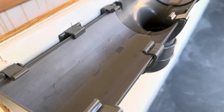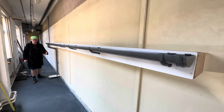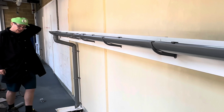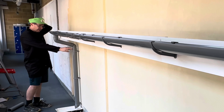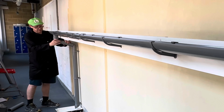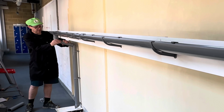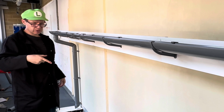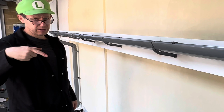this section of guttering. So in the first year you do guttering at a low level, and in the second year you do it at a higher level, working off mobile towers. A couple of things to be aware of. None of these fittings are glued in because they need to be taken apart for maintenance. If they've got blocked up with leaves or blocks, they can easily come out and can easily be taken apart. Now you know how to install guttering, it's your turn to have a go.